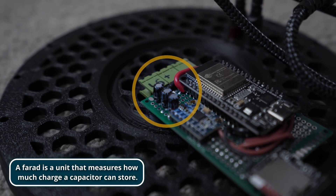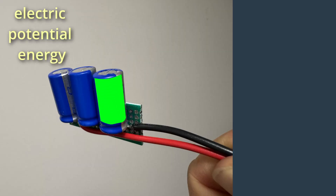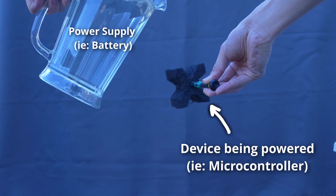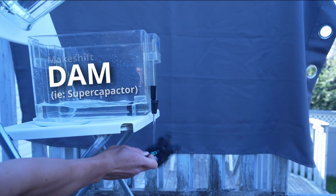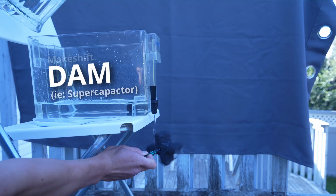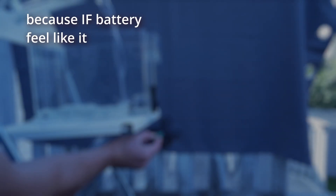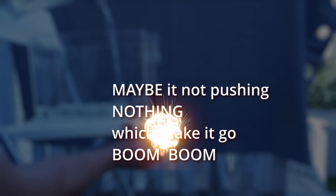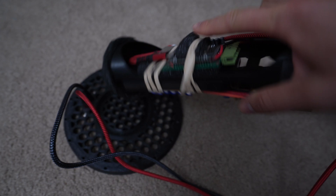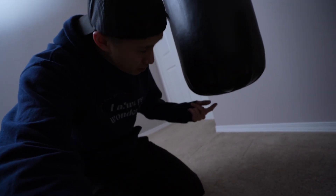I already had around 600 microfarads of capacitance on my 5-volt rail but that needed an upgrade, so I bumped it up by exactly a million percent. For context, a capacitor stores electric potential energy kind of like how a dam stores water — if the stream stops, the dam can still power the wheel temporarily. That supercapacitor solution did solve the power bump issue, but the first problem it created was triggering short-circuit protection on the battery. The second problem was that without a way to cut power to the audio module I couldn't consistently reset communication to it. So keeping things simple, I downgraded the capacitance and put the LEDs and audio module power through a relay.